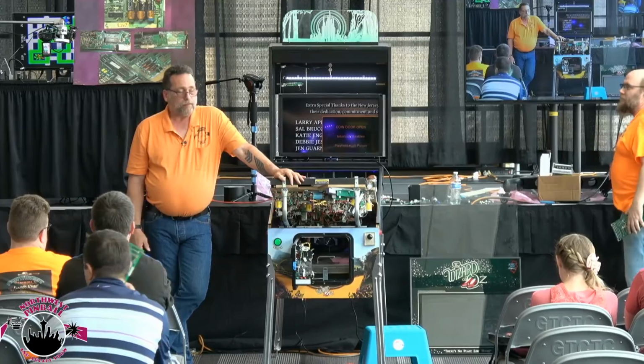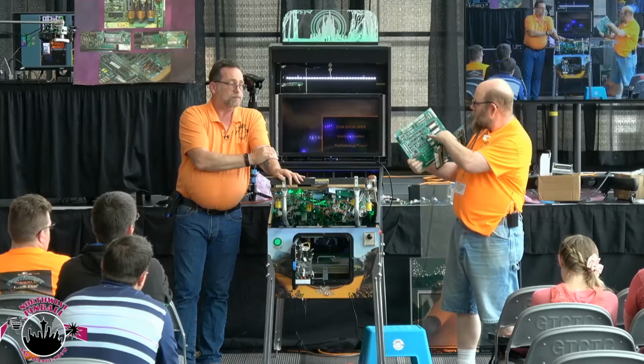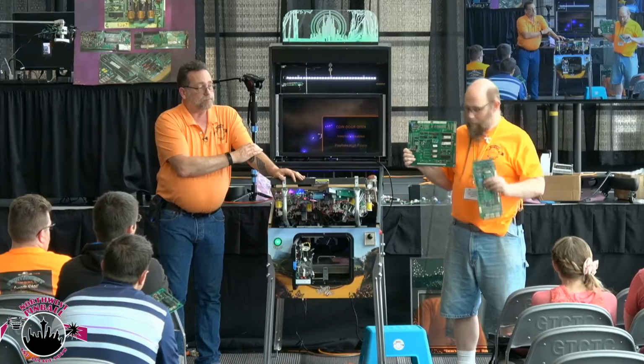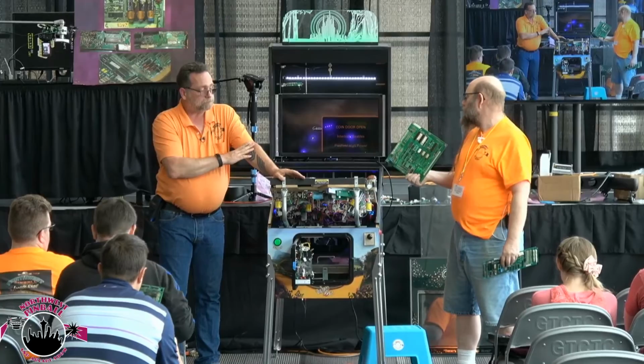The reason they come in different flavors is because of the different sizes required for the different systems. The large board that David is holding up is a Williams System 7, which uses a 5101. That would also be the same thing used in a Bally-35, or the Stern 200 uses two of them. And also Stargate, Defender, Robotron. It's not just pinball.